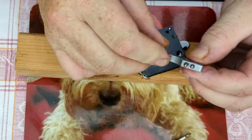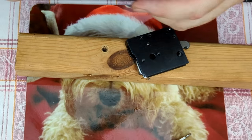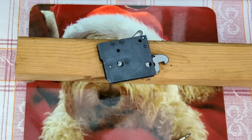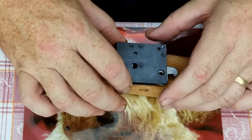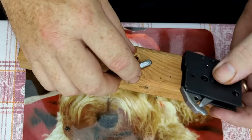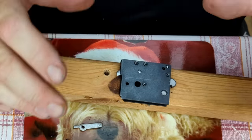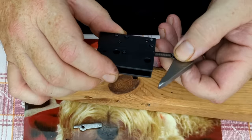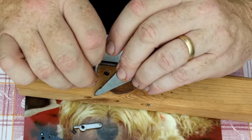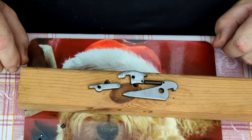And there is our trigger blade. As you can see, we have our two grub screws that you adjust from these two here - but we'll come back to that in a minute. For the time being that will go in our pot. And now we're going to slide out and take our sears out. I noticed I had it cocked and was taking it apart with the trigger cocked - because of that it won't come out. And there we go - there are our two trigger sears. Now we'll talk about the bits that you need to polish.